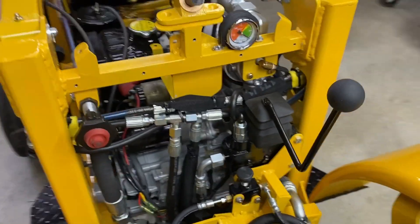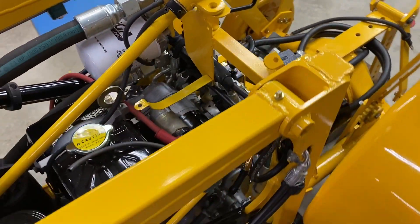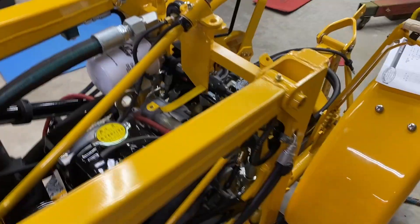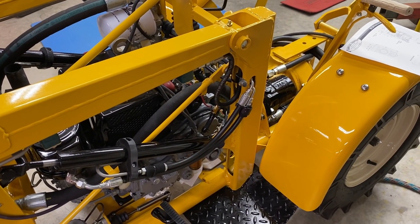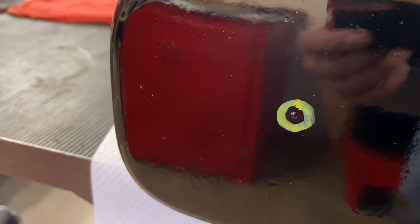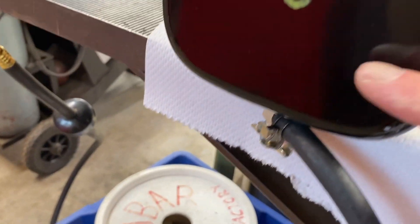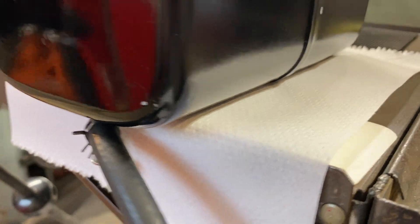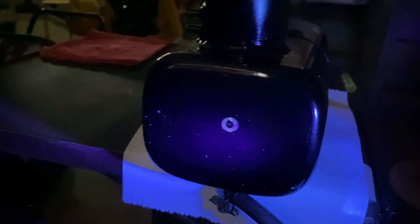The other problem I had was the fuel tank was leaking. I thought it was one of the fittings on top on the vent, but then I noticed the tank has a spot on the side that was just oozing — leaking right on this end where that red and yellow circle is. So right now the diesel is lower than that point, and I'm just checking to see if there are any other leaks. I'm going to sandblast that little area and then use this marine weld.